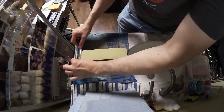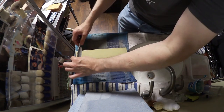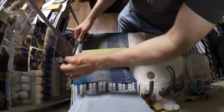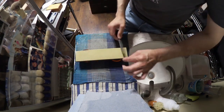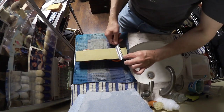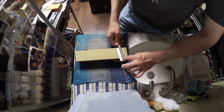What did I see? I saw these new finer scratches taking over approximately the first half of the width of the bevel. And the cutting edge looked very fine, except one or two spots still had a couple of tiny pieces of missing steel, sacrificing some of the thinness of our bevel made on the previous step by honing more on this longer shaped wheel, because we need to remove the degradation that the first step did to the cutting edge. You don't want to have any little bumps on there that you can see at such low magnification when you're shaving. Now, when I go to the Norton Ascent, it's going to take those type of things right off, as long as I get them real, real small.